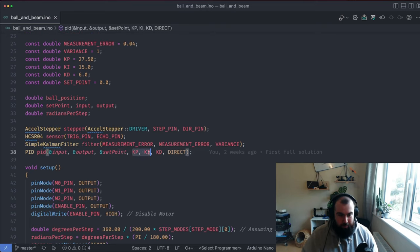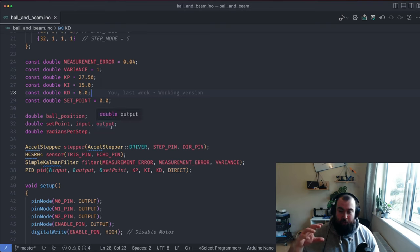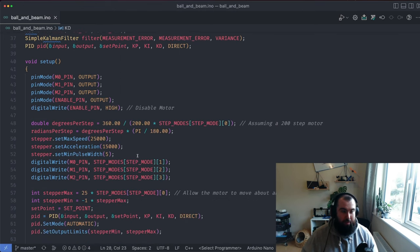We also have Kp, Ki, and Kd gains — the PID gains. I'm not going into these because I want to do a whole video on what they actually mean, but just be aware that these are the knobs you can turn to adjust the tuning of your PID controller. By changing these three values you completely change the characteristics of how the machine will operate.